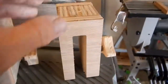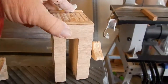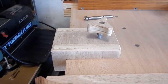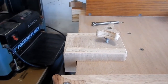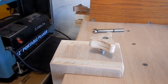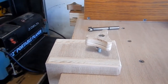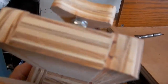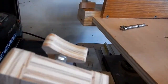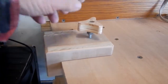A little sanding on the one on the left makes it nice and usable — feels good to touch, not sharp. Take all the sharp edges off of it. This one here will just flat touch you on your edges, so it's always a good idea to round them over and clean them up. Moment of truth — there it is. I'm not going to crank it down because I want the glue to set overnight, but there's my three-quarter inch plywood and it makes a nice tight fit — snug on there as it is. It'll take a little bit to clean up, might put a little wax on there to make it more movable. But it slips on, slips off just fine. With CNC machines you just can't beat the quality — press, cut, and every one of them is cut out the same. Really nice little feature. Nice and tight, and that thing will not move once I put pressure on it.